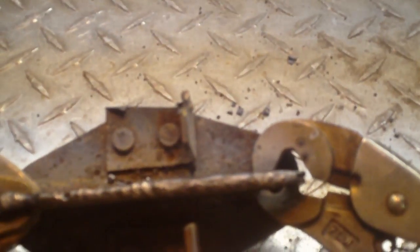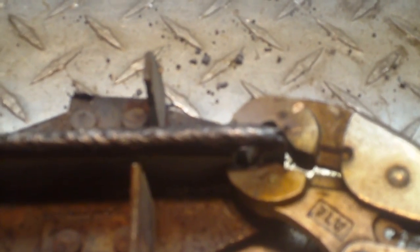That's pretty amazing. All my other welds I've done so far, I've done at a much hotter setting — there's a ton of slag left on top. Now that I've adjusted my welder to the right heat, you can see the penetration right there. I got a little more towards the right than I did on the left.